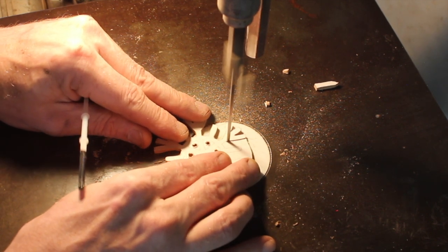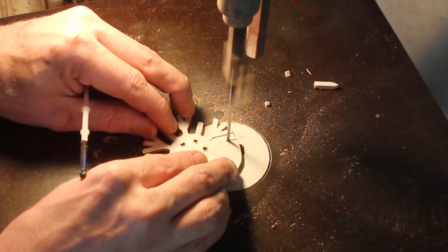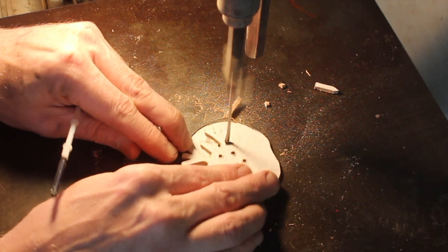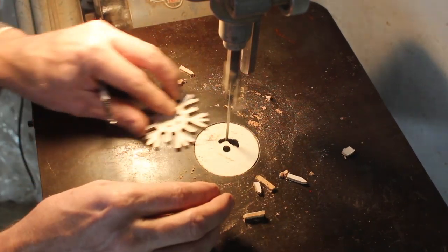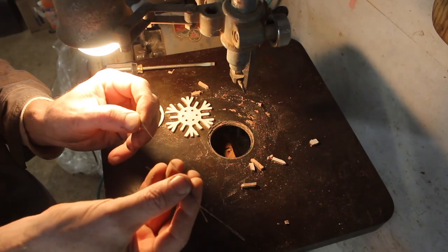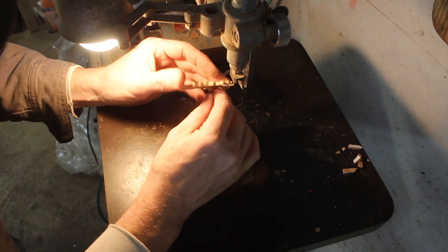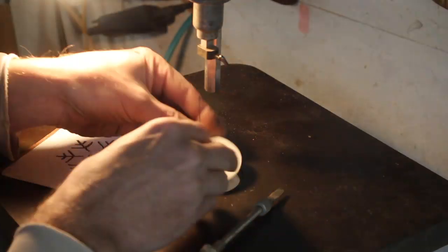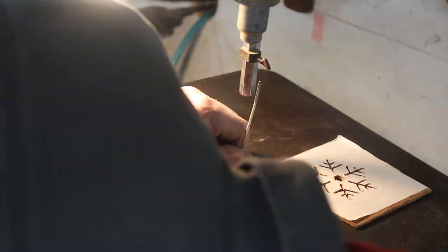I only did a couple of the simpler patterns to make life a little easier. You can see I'm using a pretty big blade to do the bulk of the cutting because I'm more confident with it and it's a bit quicker, then I switch to a smaller blade for the smaller more detailed cuts. I don't know the TPI for these blades, but the first was the most aggressive I've seen for the scroll saw, and the second is the finest. My machine is a little old and out of tune, so keeping that small blade tight and straight was difficult — and I'm a little old and out of tune too — so it was definitely slower going.